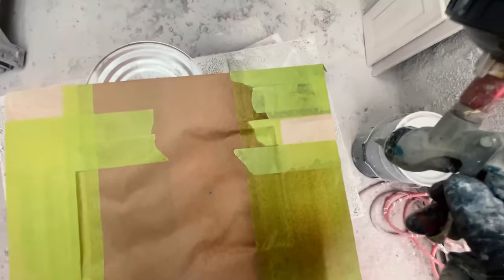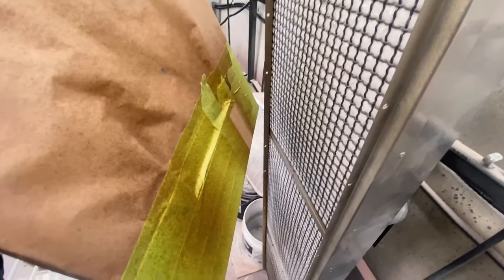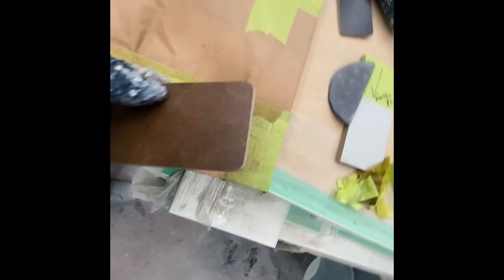I'm ready to go with my next sample, my next section. We're a lot closer to the tonality in terms of reddishness and brownishness — this is just the first pass. While I'm working with the stain sample, I have the solid color being matched as well. This infrared catalytic system helps a lot in terms of curing, drying, and speeding up the process. If you own a shop, this is absolutely a game changer — we have two of them. This is dry, we'll do another pass.